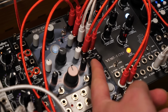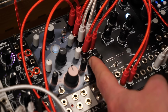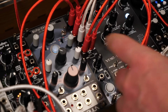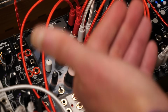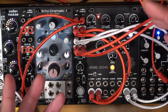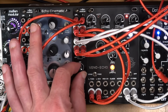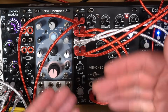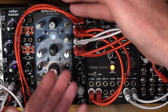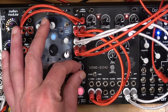Next down is the FX gain knob. Now this allows us to balance the output of effects, because so often, I don't know if you find this, but Eurorack effects modules tend to steal a little bit of your level, particularly when you're mixing the wet and dry. You tend to lose a little bit, and so this allows you to boost things up, or if you're using distortion or some other drive and overdrive type effect, it allows you to turn it down so it's not unbalanced from what's going through. So you've got a zero unity coming through of your signal, and then you want to be able to match that with what's coming through from the effects loop.